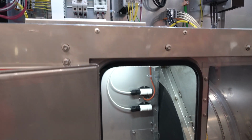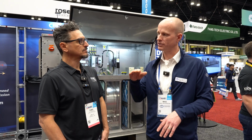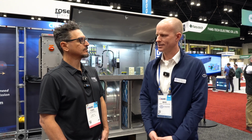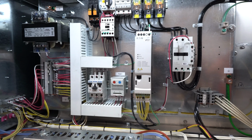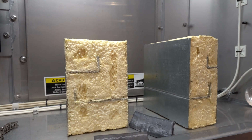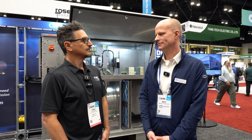Very low. But generally speaking, we don't even start looking at desiccant applications until below about a 45-degree dew point and lower. Within that range, there are 3 or 4 categories of desiccant configurations and systems that align well with the application need. So the battery is on the extreme dry end. Then you have surgical suites, maybe, or an ice arena. Those are a different category, above zero dew point typically. Usually teens, single digit, something like that.